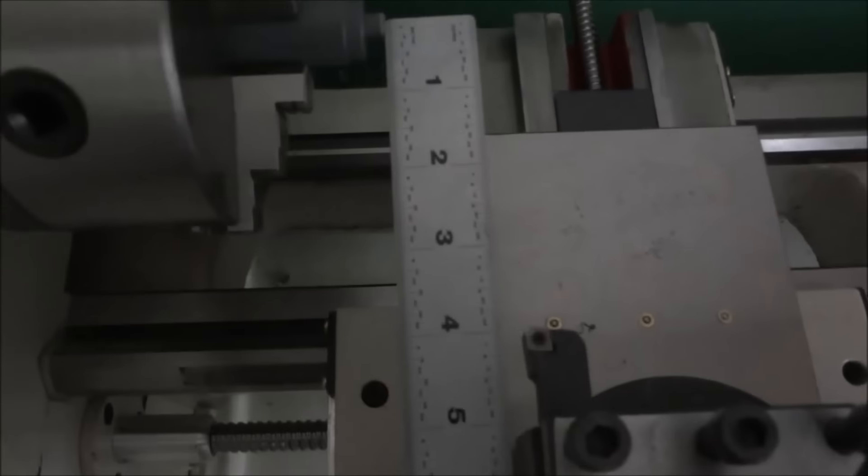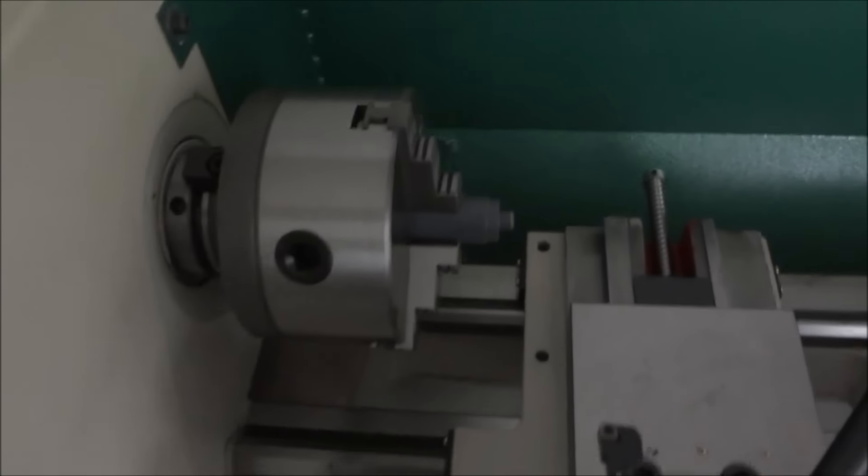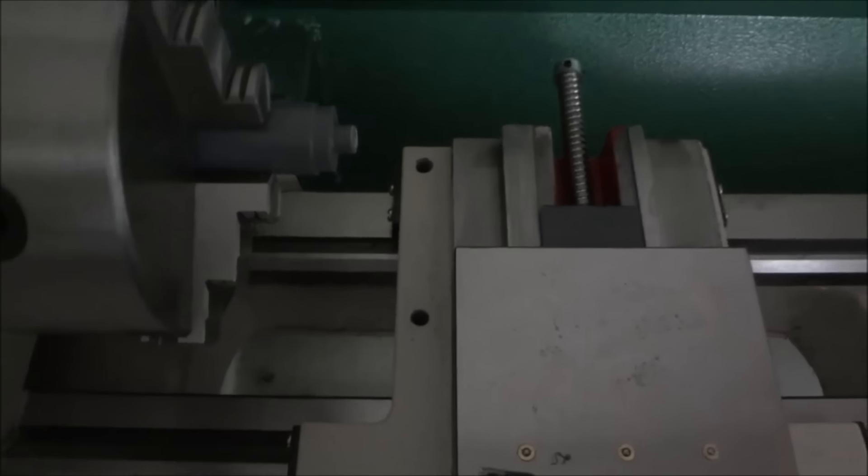That's right about on my center line — I apologize for the lighting, it's a rainy day out. You can see I have about 4 inches, and so that'll give me an 8-inch diameter. I probably would not turn anything more than a couple of inches — maybe 3 inches in diameter — on a regular basis.